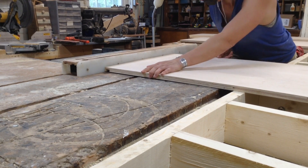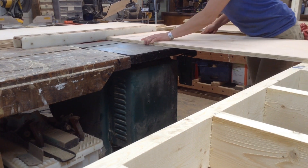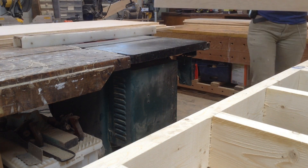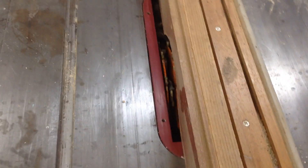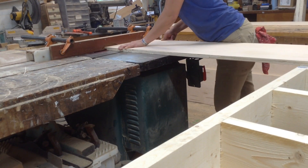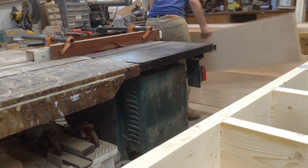That bottom dado leaves a little bit of a foot on the bottom. You do not want flat bases sitting on top of your base — it's only going to have those two contact points on either side. It's really difficult to find plywood that's totally square, especially in big sheets, so if you have a flat base sitting on top of the base you made, it's going to wobble. If you only have two contact points to level, it becomes much easier. I adjusted the wing so I could slide between the wing and the table saw, push the boards with my hip. I put the bottom dado — which holds the bottom shelf — at one inch from the bottom, then I did the tops, cutting them flush.